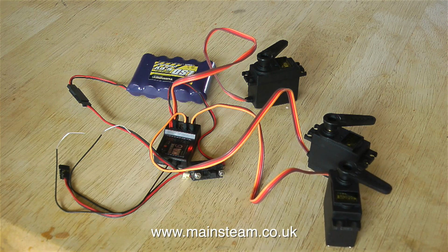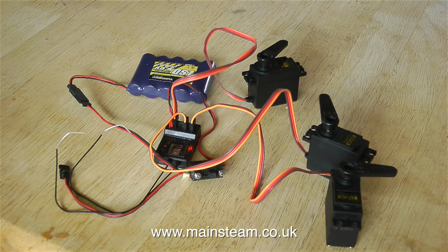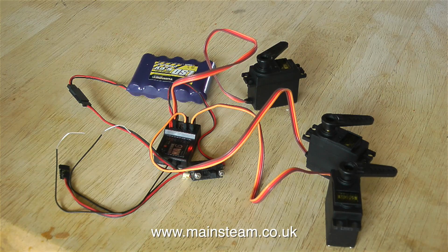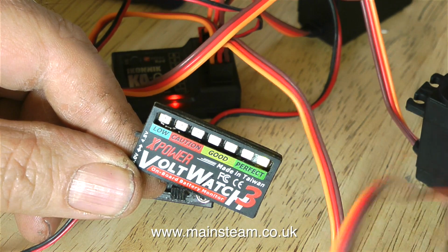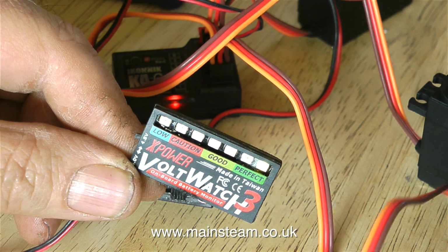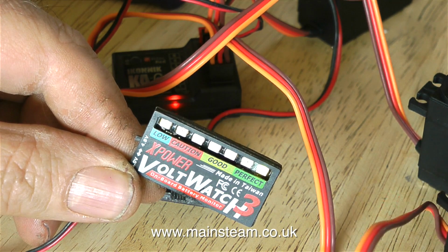I'm a little concerned about my original plan of maybe using a dry cell pack in the boat, like I did in the last steamboat that I rebuilt. But the layout of the servos in this boat necessitated the use of a Bowden cable to operate the rudder, so I'm a little concerned that the extra friction of this long Bowden cable may require more than dry batteries to provide the current to operate the servo.